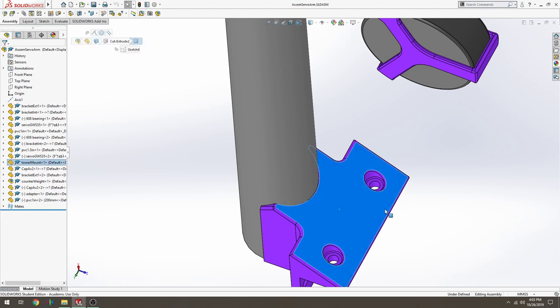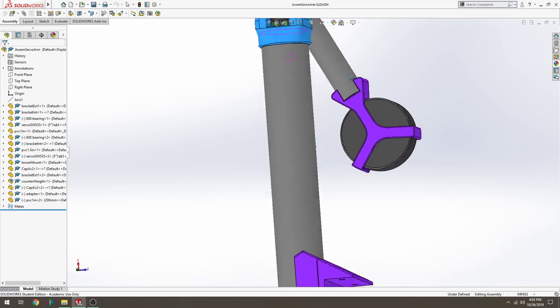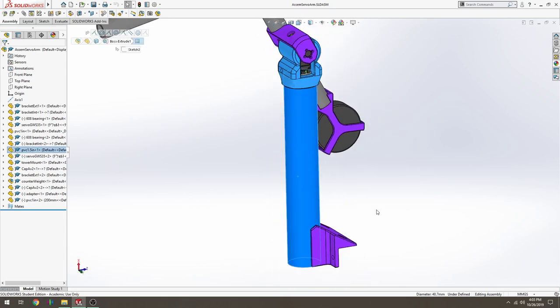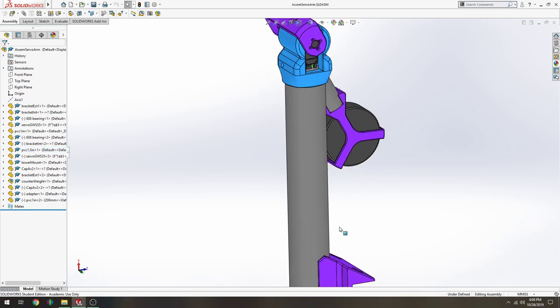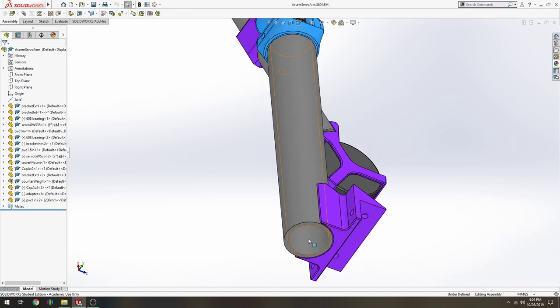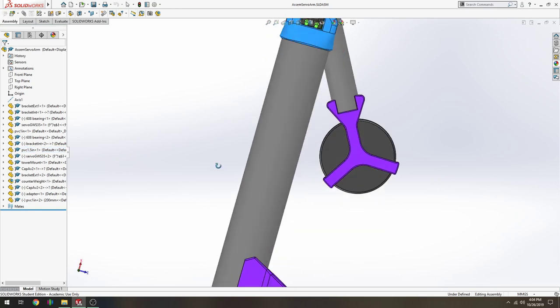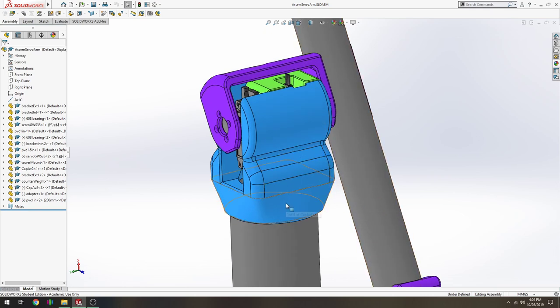And it prints best if this is the face set down to the platform on your 3D printer. That's how you get a good result for printability. The first tower is a 1.5 inch PVC tube, or CPVC. I like the CPVC because it's gray. And 1.5 inch describes the nominal measurement of the inside, not the outside. So you'll find that if you dissect the model.